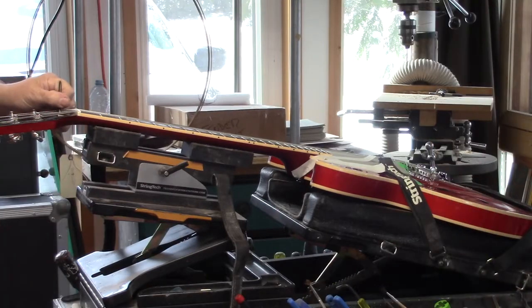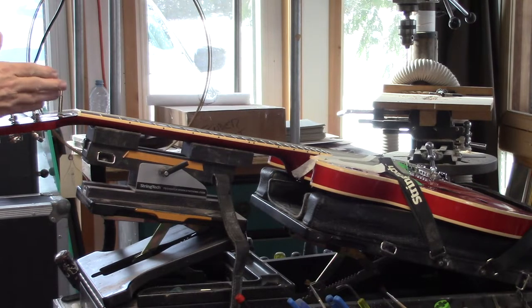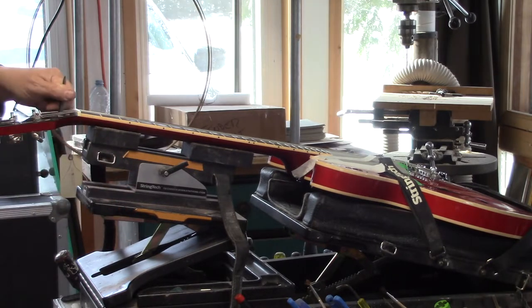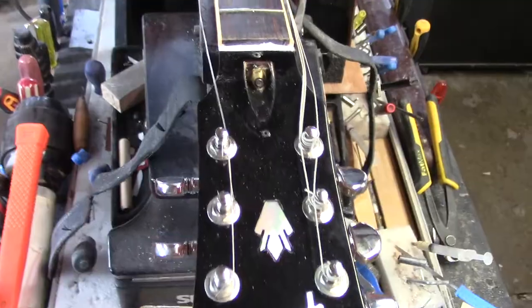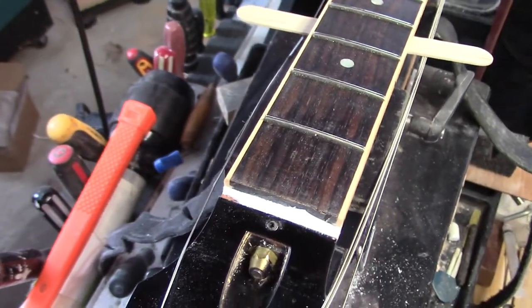Just eyeing that neck, I can see there's definitely more of a swoop on the treble side than on the bass side. One of the things you need to understand is the truss rod goes up the center of the neck — the neck does not necessarily react nice and even, treble side versus bass side. We've got it as straight as we possibly can; there is definitely a high spot on the treble side. Here's another Gibson nut coming out like an impacted tooth — and as always, we'll get it right out on the glue line.